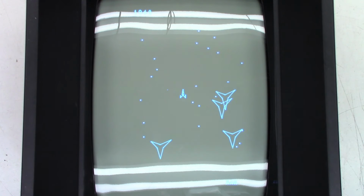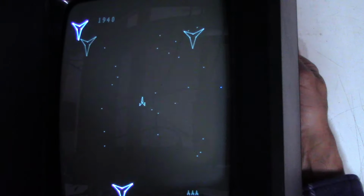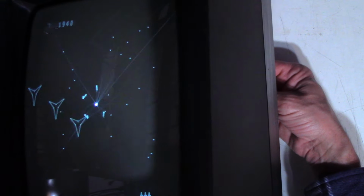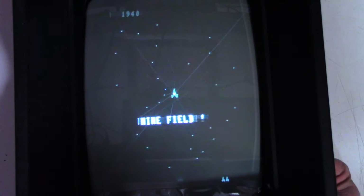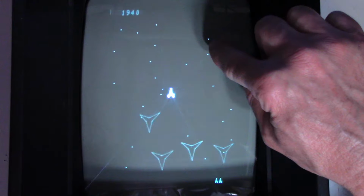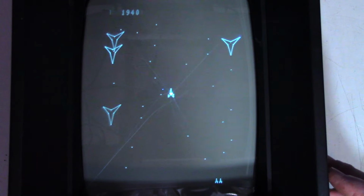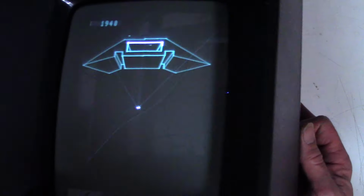Yeah, let's turn the lights off. And just as a little extra bonus feature, I will turn up the brightness and you'll actually be able to see the retrace line. So normally you don't get to see that when the brightness is down, because it basically eliminates that. So you can actually see the beam moving out, painting the dot, coming back, moving out, painting the dot, coming way over here to something. I don't know what's going on way over there, but anyhow, that is how the Vector system operates. So let's turn it back down until the dot just goes out in the center of the picture.